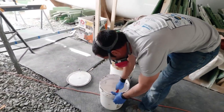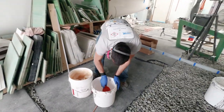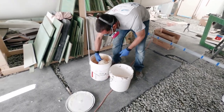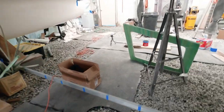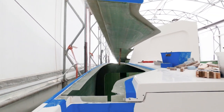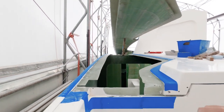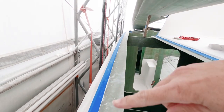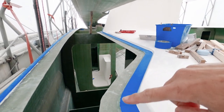Since it has been cold, we've been storing the methacrylate inside the heated bathrooms here at the marina, especially since it's basically just us living here now, so we can deal with the smell. We put it in a big bag to contain that, and we've got the hardener — the catalyst — stored way back here as well. We just scoop some out into a Folgers jar, so hopefully warming it all up will make it cure faster than if we'd left it in the tent. Matt is going to be starting while I'm down below bagging — he'll get inside the holes, sanding wherever he can, then get up and over and put the bead down all along the outer edge and where it matches up to the cockpit seat — should be easy access.